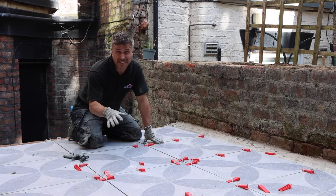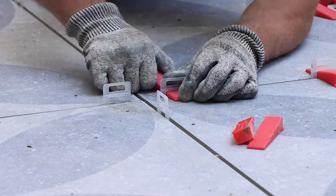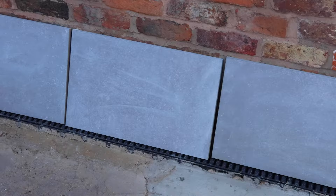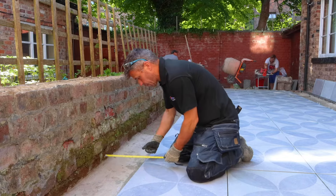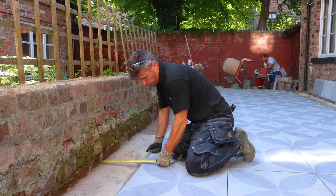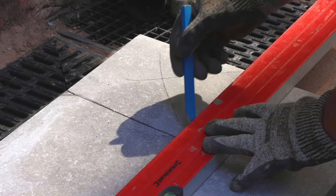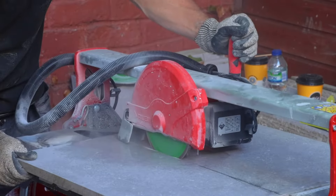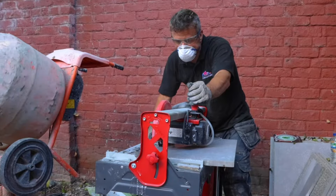So now this area has had 24 hours to completely dry. I can walk on the tiles no problem and I can start to remove all of my wedges and snap off the clips. As for my cuts on both sides, I prefer to cut a stockpile first and line them all up exactly where they're going to be installed. I start off by taking my measurements from the actual wall edge or drain edge to the existing tile that's already fixed and dried into position, then deduct that by 10mm, mark that on your tile, and then you can start cutting. I'm using a wet electric tile cutter with a diamond tip blade that applies water to the blade whilst it's being cut to keep it cool.